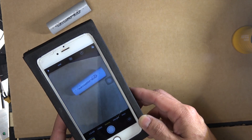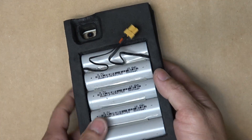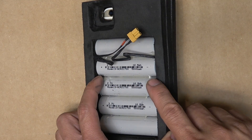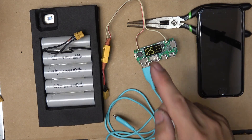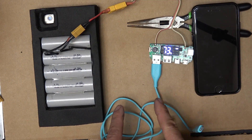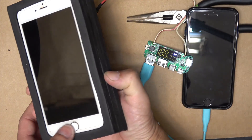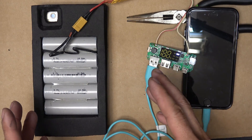It's working pretty good! On the back of the phone I made an XT30 connector that is soldered directly onto the battery terminals and does not go through the phone at all. This gives me direct access to the battery power — I can use this as a 4-volt power supply to run anything that is 4 volts. For example, I can use a motherboard from a USB power bank and plug it in to charge another phone. So basically this phone is charging this phone while this phone is still working — it's like using a Tesla Model 3 to back-feed and power your house in a blackout.